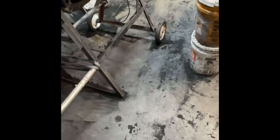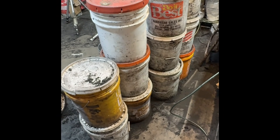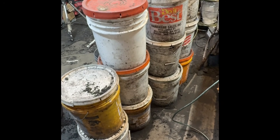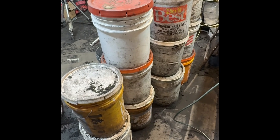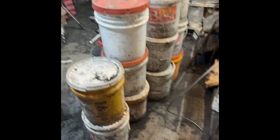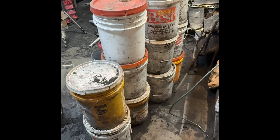What was a pile of sand on the floor is now in those five-gallon buckets and ready to be molded probably tomorrow or the next day. Each bucket weighs about 50 pounds or so — it looks like that could be 11 buckets, so probably 550 pounds of sand there. I keep it in the buckets with the lids on so it doesn't dry out over time. It'll keep that way for quite a few days in the winter, and maybe four or five days in the summer when it's a little bit hotter and drier and tends to dry out more.